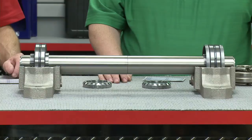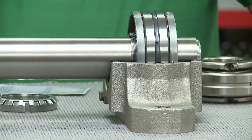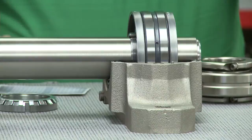But let's say we're going to use something similar to what's set up here — standard solid spherical bearings on tapered adapter sleeves. Keep in mind this type of setup always has a fixed and a floating side. You would refer to the prints to determine which side is which. If you don't have prints, mark which is fixed when you take it apart. Fixed is the side with the locating or stabilizing rings. Only one of the two bearings should be fixed.